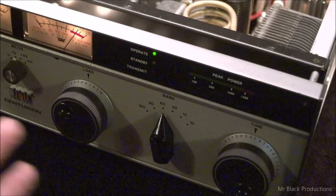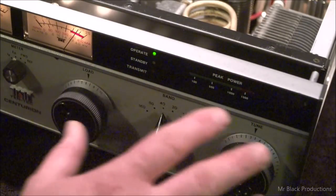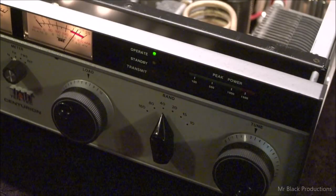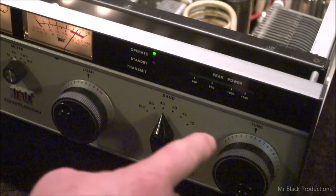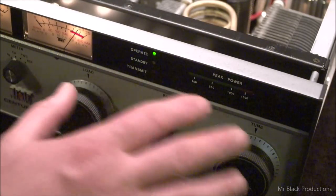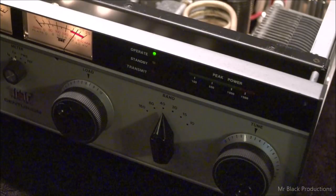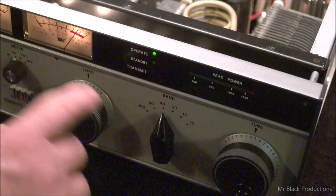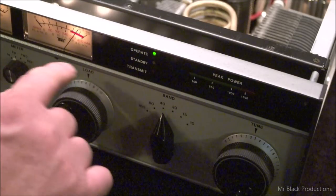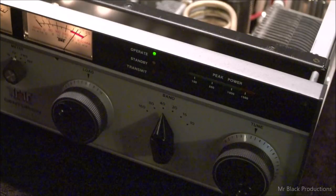It's handy if you like to operate a certain portion of the band, have your numbers written down so you can dial your tuners in exactly where they need to be. Now on the older boxes like the SB220s, they kind of played at this, but this is a direct gear drive and you're going to be able to re-emulate the numbers with very good precision. The SB220 they tried, they just got a print on there, and what I tell people to do is put a little piece of post-it note on the back of it and put a little mark on it and write on it, or use a label maker.